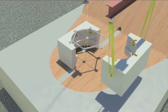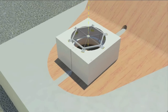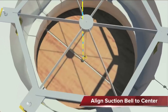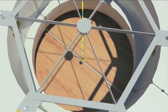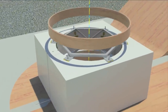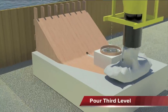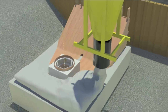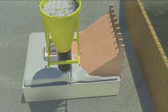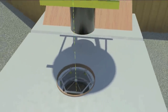The second prefab element will be positioned and aligned by the positioning template. The next step is filling of the joints and placement of shuttering on top of the prefab. Then we can start with the third pour. It is important for this pour that the top surface is smooth and level, because this floor will be used as the foundation of the pumping station volute.